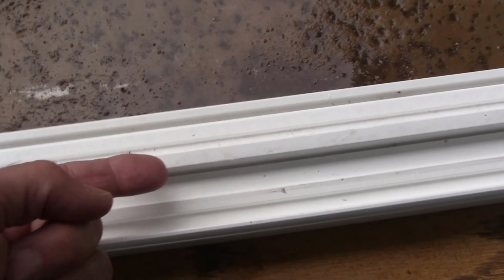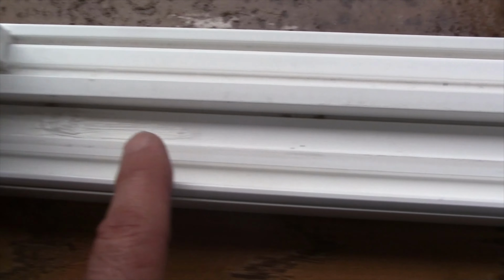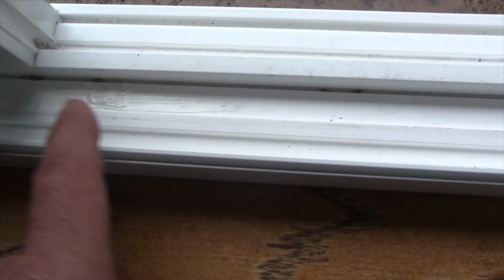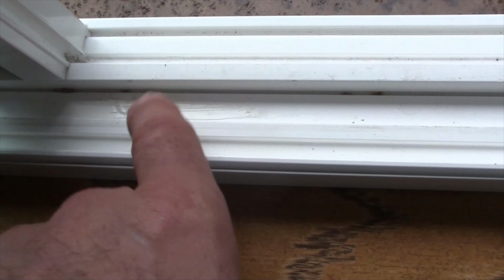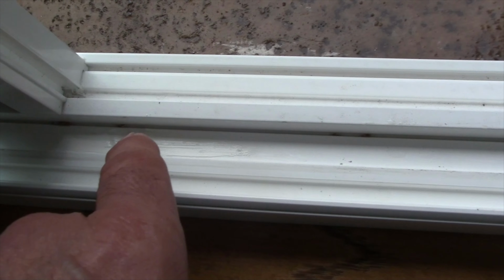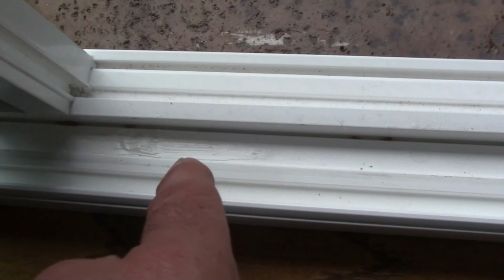If the water comes in through wind-driven rain here, it'll come into this track and go down here. There's an internal channel that will take it over to those weep holes on the ends of the window, and there's another one over there. So I just don't want my screw hole, because I put it on the wrong side, to get any water damage at all due to that wind-driven rain. That was the mistake. It was an incorrect procedure on my part. I'm new to windows. I just started installing windows, and that was a mistake I made. I don't want you to make that same mistake.